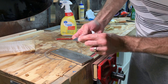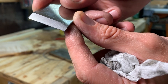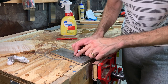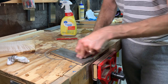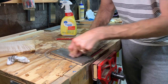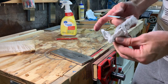That's got a burr all the way across — see if you can see the nick right about there. You can actually see that wire edge hanging out on the iron. Back to registration — come up just a smidge more and I'm going to see if I can just work that little nick out right here on the 3 micron DMT extra extra fine stone, without having to go to a coarser grit. Frankly, I don't go to a coarser grit very often anymore.